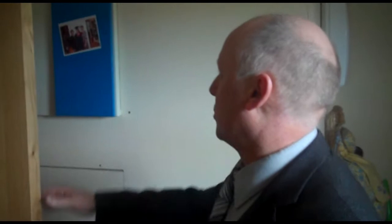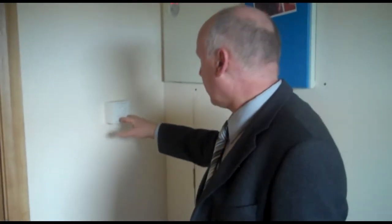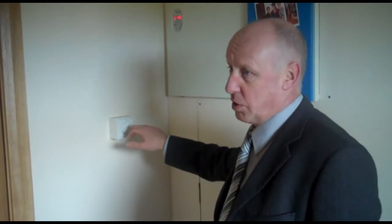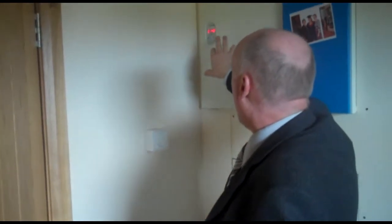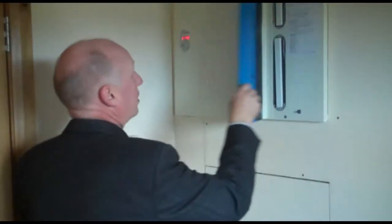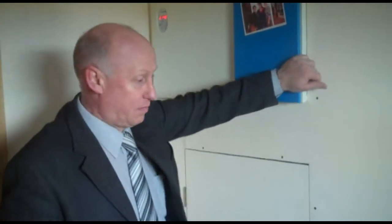A lot of people put them in the roof space, but we didn't like to because it's easier to maintain. There's a wee clock on it here. You have your three settings — it sits in the middle setting, and if it's very hot you can turn it up to three; if it's very cold weather you can turn it down to one. This tells you it's on setting two, and that's 140 cubic metres an hour of air change. The two filters inside are easy to access and very easy to work with.